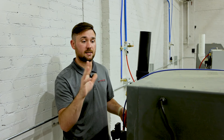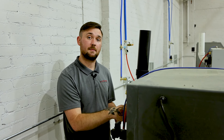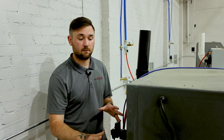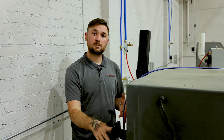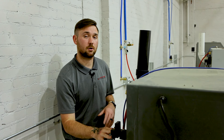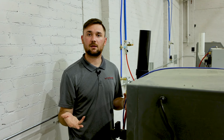You have an air inlet here which sends air to your gun — this is where the line from your regulator connects to give air to the blast gun inside the cabinet. You also have the window rinse solenoid and the water rinse down solenoid, which supply water to each function. Your water does not need to be pressurized on an open loop system because the solenoid fills the line for you. You also have a timer on the back to adjust your window rinse interval.